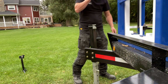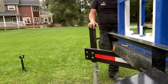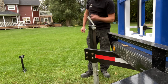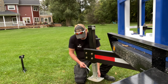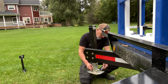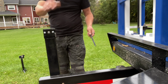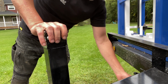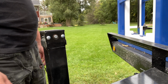If you're out in the field and you're doing a lot of light work, you know, you're not using supers, you're just moving empties around or something like that, it's quite possible that you won't even have to use your outriggers at all, but they are there for your safety, and it also helps with auto level. If you don't have to, the trailer isn't dipping on the axles and the springs, that just means that you'll be using less power on your batteries because it's solid, it's not moving, so you're not fighting the movement of the trailer itself on the axles. So these actually save you some power in the long run, save your batteries. So I like them, I would use them.